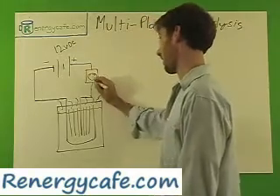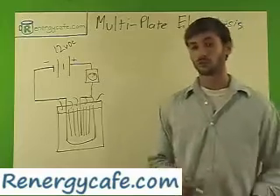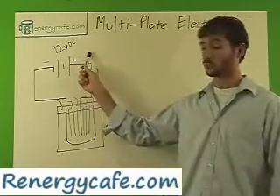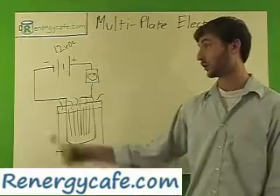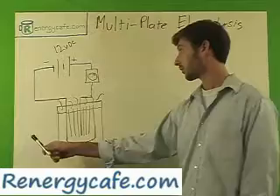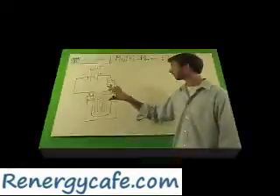Something you want to think about here is that with a 12 or 10 gauge wire — which chances are you're using that or something smaller — you don't want to go too high as far as amps. At 20 or 30 amps you're going to be getting into a danger zone depending on the wire size; 20 may be too much if you're working with 14 or 16 gauge wire. So really be careful with that — you're going to want to get an amp meter before you start playing around too much.